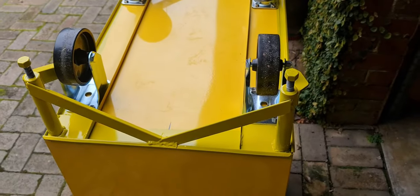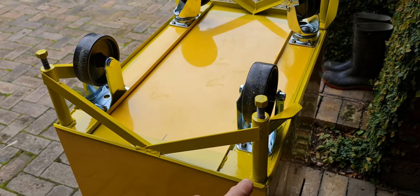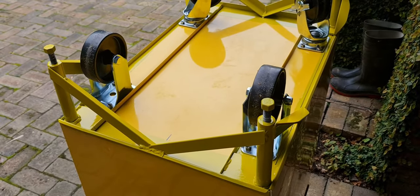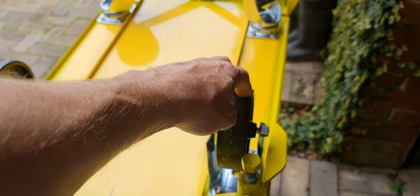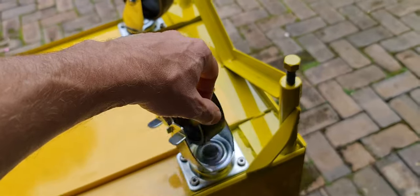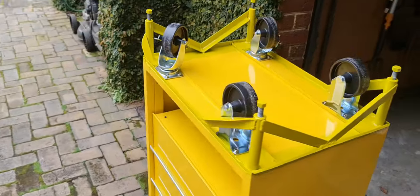It's all welded up now. As per Robin's video — I'll put a link in the description — he also found that even though these posts are quite solid, you get a bit of flex. So he welded in a couple of extra ties. I just got some angle iron and welded it up like that. It looks a bit Heath Robinson but it seems to do the job. It's quite a tight squeeze, especially on these ones where I had to make the cross-ties really short so they didn't foul on the casters. The yellow paint is all I had in stock and it's not exactly the same shade, but that'll do.